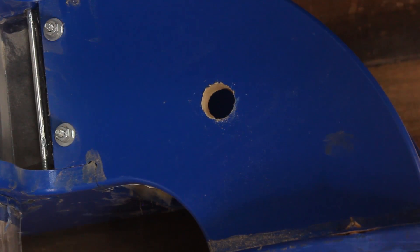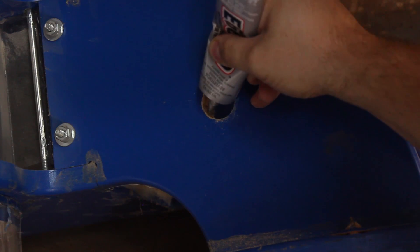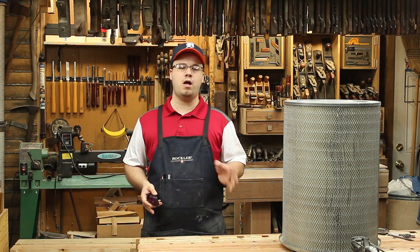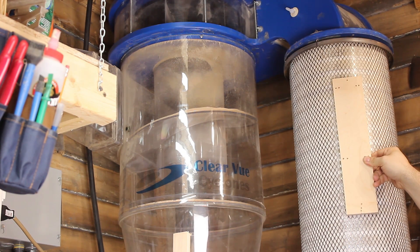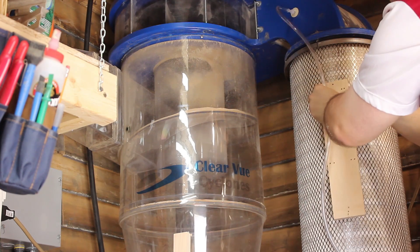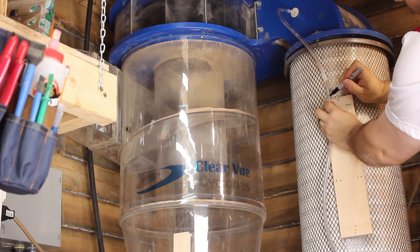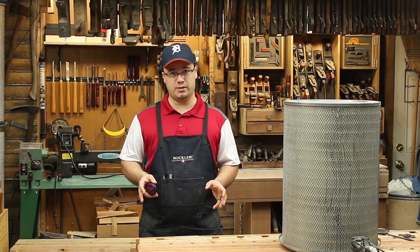The hole has to be large enough for your stopper to fit in without pushing all the way through — for mine that's an inch. Drill a hole in your rubber stopper so one end of the hose barb fits inside it. Use some goopy adhesive to glue the hose barb into the stopper, then glue the stopper into the hole on your collector. Find a scrap of wood about four inches wide and 12 to 14 inches long — this is what your gauge will attach to. Mount it somewhere handy and close to the rubber stopper. Stick the tube onto the hose barb and run it down to the plaque, marking where it touches the top edge.